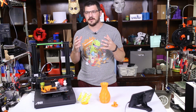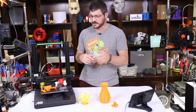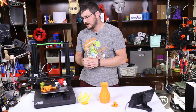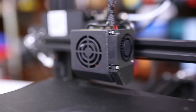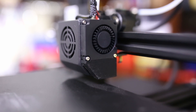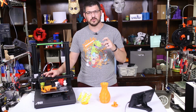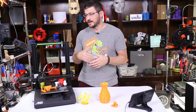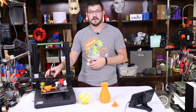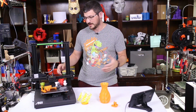There's a lot of things going for it, but the way it was implemented by Anet is just super subpar. Let's get the specs out of the way first. It's 235 by 235 by 250 on the Z. It sports a 0.4mm nozzle as the standard. It has a little crummy 4010 blower fan on the side, which is the same thing Creality uses on all of their machines. It has a very Creality-esque hotend — a little bit shorter heat sink, but very much the same. It is a Bowden printer. This is nothing unique happening here, except maybe the bottom chassis.